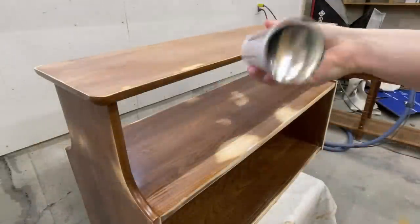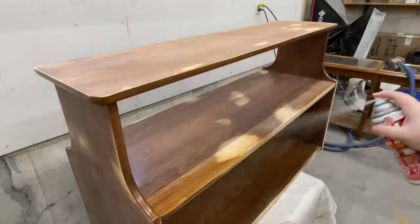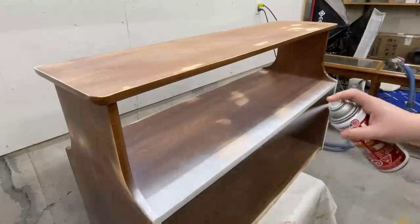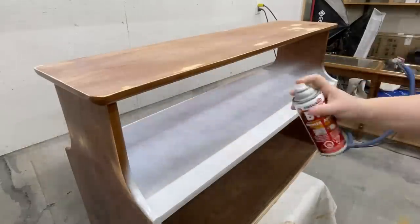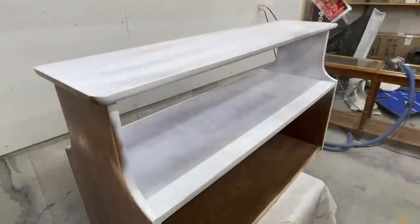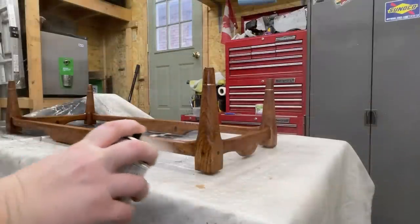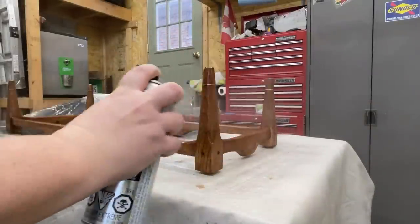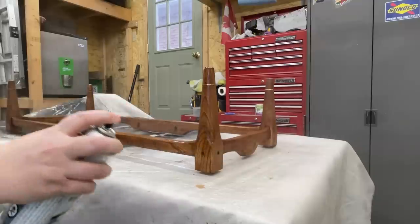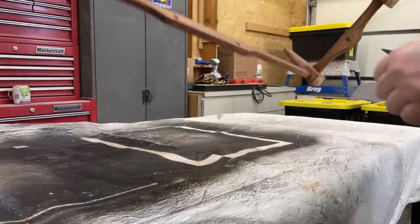Before I could paint, I needed to prime and seal up all of the porous bare wood and wood filler spots. To make things easy, I grabbed a can of my favorite primer and applied two coats. I also wanted to seal up the newly stained base, and I've had this can of Watco lacquer in my supply closet for as long as I can remember, so I thought this would be an easy way to go. I gave it a good shake and then sprayed on a total of three light coats over the base.